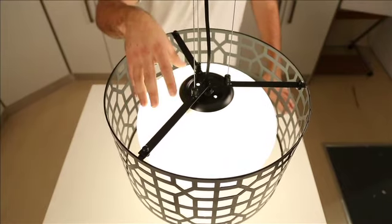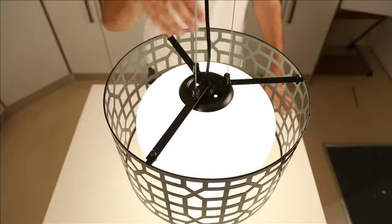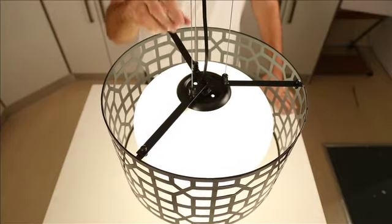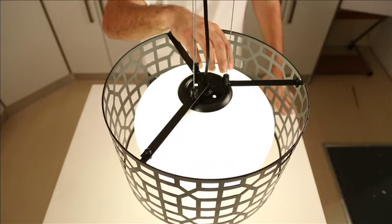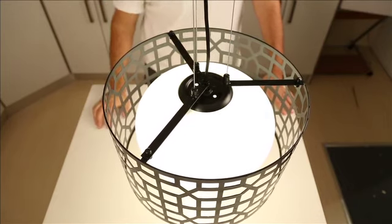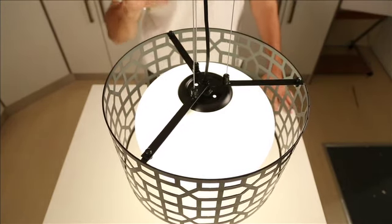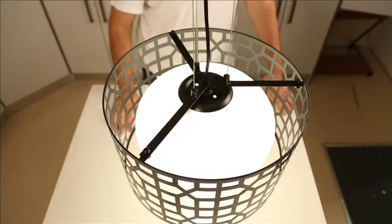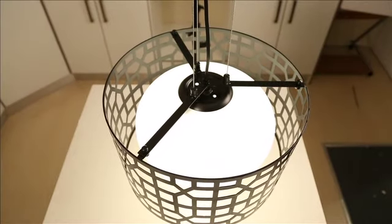What I'm going to do is remove this glass and show you how to do that. It's important to know that it's best to put this on when it's on the ground — you're going to find it difficult to do while it's in the ceiling. So when your electrician is putting it on, it's easier to tell them to put it on there first. I also recommend using an LED because you don't want to be changing it too often. It can be done, it's not difficult — this is just set up on a little rig right now to show what it looks like.